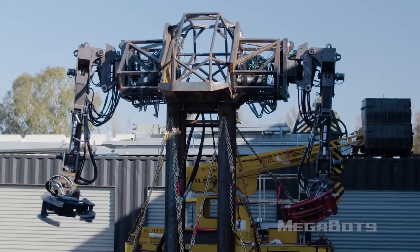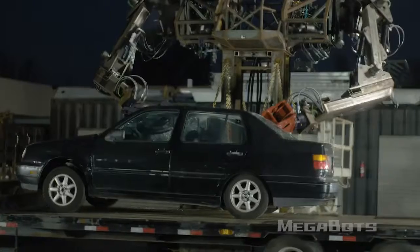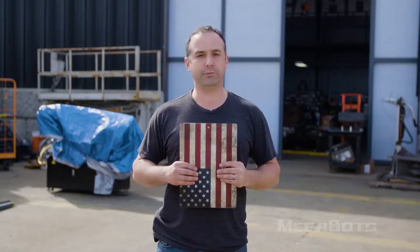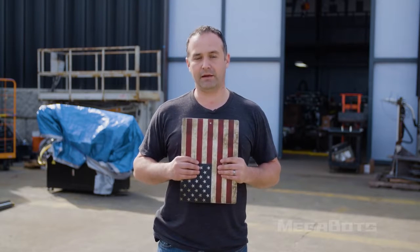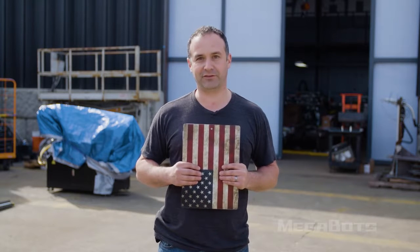So the reason we're using hydraulics is because hydraulic power systems are really good at moving big, heavy things really fast and really smoothly. Most people see fluid pressure every day on the stuff that comes out of the faucet when they turn the handle. But our fluid is under a lot more pressure than that, about 4,000 psi, somewhere around 100 times what you'd find in your kitchen sink.